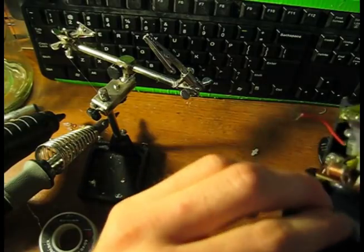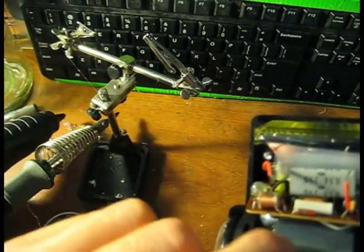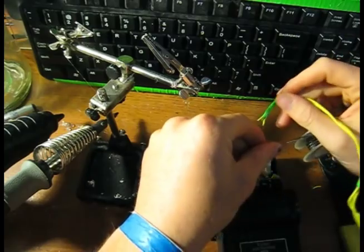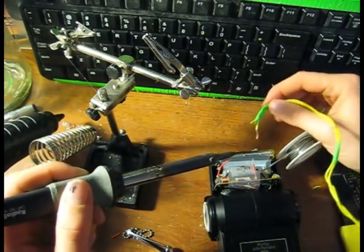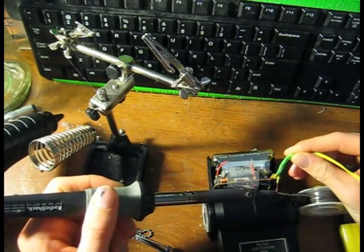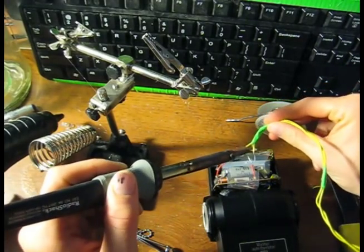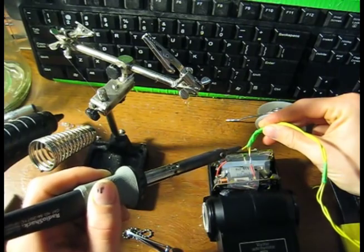Okay. Here you've seen the wonderful brilliant red wire sliced open and ready for splitting. And that's just what we'll do. Simply, I'm just going to take one and connect it. In fact, if you want to, you can heat up and tin the tips. Tin this tip. And then I want the two laid together. Perhaps they can fuse effortlessly. Just like that. Beautiful.